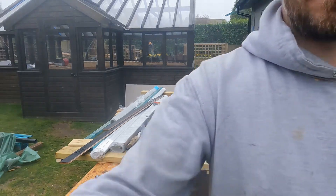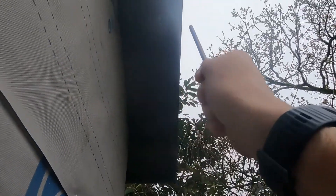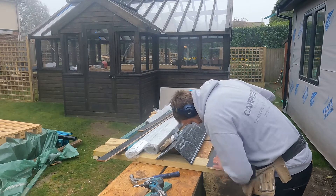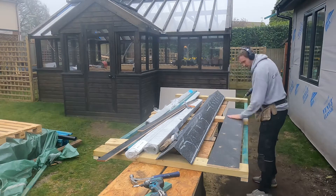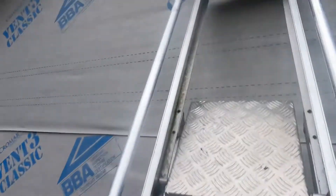You can see the distances are about 50mm all the way up through the run, so when you look up there it's lovely and even all the way through. Now we just pre-drill our holes. As you can see, I've put the insulation up there in the void and I'm just going to be fitting the ply.